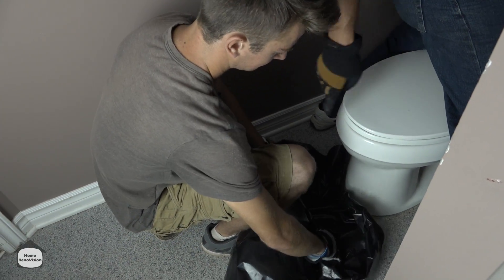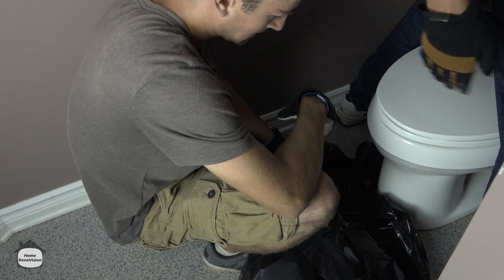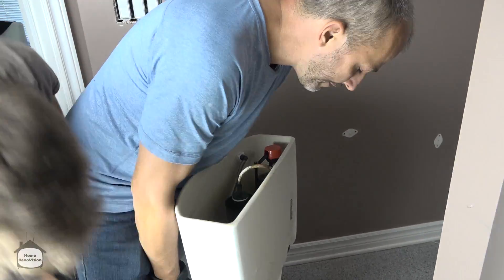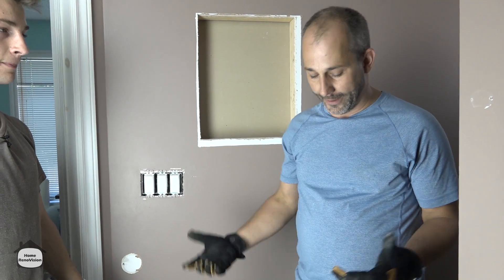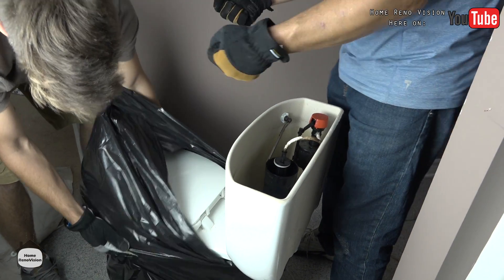So basically what you do is position yourself like this. What Matt's going to do is bag the whole toilet using a large construction bag — three mil plastic, very thick and strong. My job is just to lift the toilet straight up in the air and hold it while he bags it. And up we go. Now I'm going to walk out so we can show everybody. Come right up the other side as much as you can, and we'll set this down. Now we have control over the water — if any water inside that toilet spills over that P-trap, it's going to be trapped in the plastic bag while you're carrying it out. This also makes it easy for two people to carry, because I can hold the tank and grab the plastic itself.